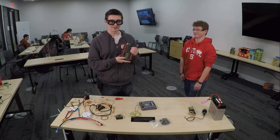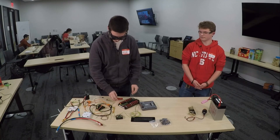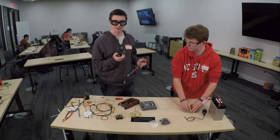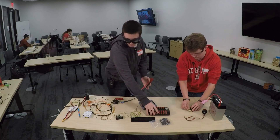This is the power distribution panel, and it sends power to all of the other components on the robot from the battery. The first thing to do is attach the battery to the power distribution panel. We do this through our main 120-amp circuit breaker, which is essentially the on-off button of our robot. Let's take the cover off of our power distribution panel.